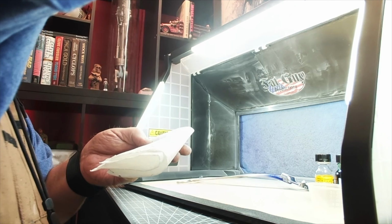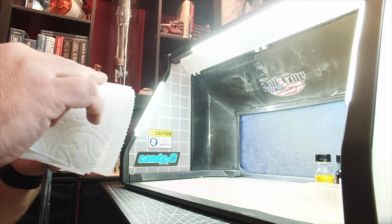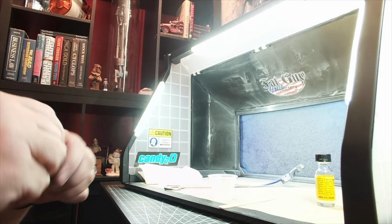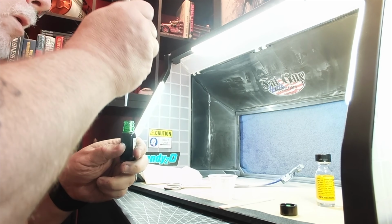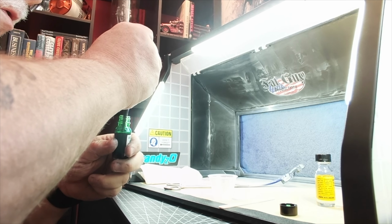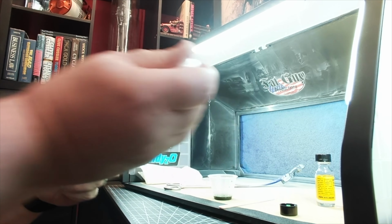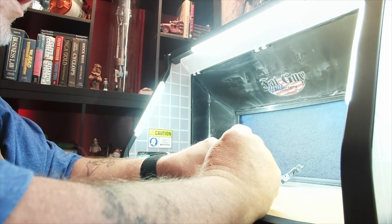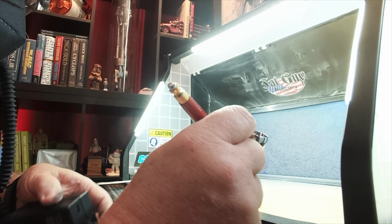So over here at the paint booth, the first thing I'm going to do is wipe the casting down using a little isopropyl alcohol, just to get rid of residue from the polishing and make sure the body is nice and clean and the paint will take. Then I can go ahead and start mixing up the Spectra Flame colors. Like I said, I'm going to use an apple green, and it's Spectra Flame paint that I got from the Redline Shop. I'm going to mix it up with a little bit of the hardener, stir it up, and then we can start to lay it down.